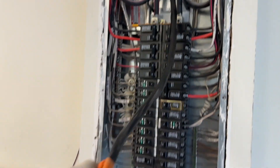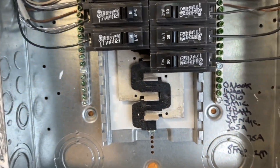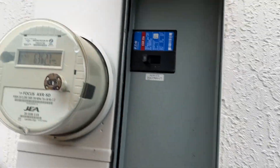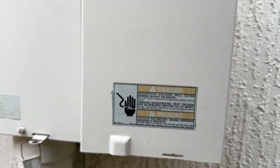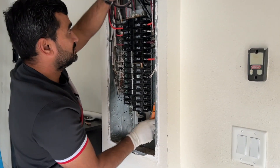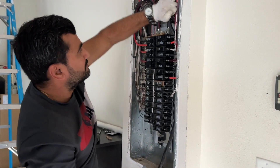I'm inserting the cable from the wall and it came out from the circuit breaker. Now I have the other end of the cable inside the breaker box, and I need to connect it to the breaker switch and install the switch. Before doing that, make sure you turn off the power to your home from the main shutoff switch, which is usually outside on the sidewalk. I've turned that off, so there is no power coming into my circuit breaker. Now I'm running the cable neatly behind the other wires inside the box.